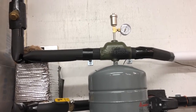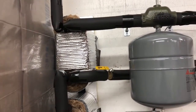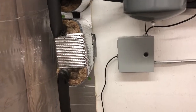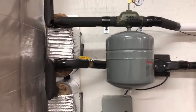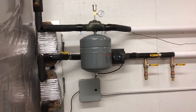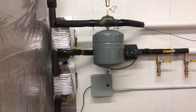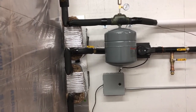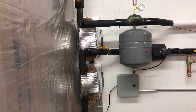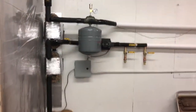That tells me I could have used a bigger plate exchanger. To resolve that, since I have a second exchanger unused, I'll probably add it in series — putting the two plate exchangers in series with the house loop — and hopefully get higher temperatures delivered to the house. When it comes to plate exchangers and water-to-air exchangers, I highly recommend you oversize, and then go another size bigger yet. There's really no downside other than they cost a little bit more.